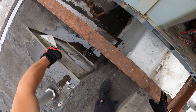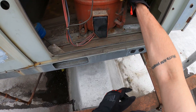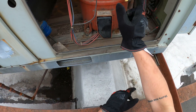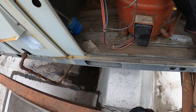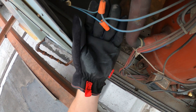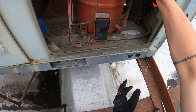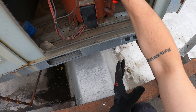Power is off. We take off the access panel, and here's our compressor. One thing I noticed right away is there is no pressure control here. This is your high side — your discharge line, your high-pressure control. I see the larger pipe, which is the suction line, and this is the low-pressure control, which is wired. There's a chance that when you see something like this, where the high-pressure control is jumped out, that this system runs on high pressure.